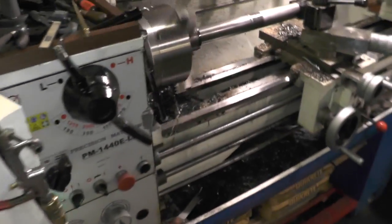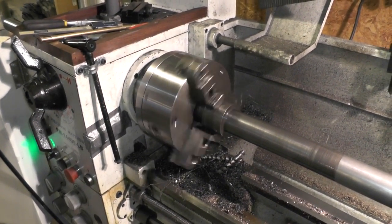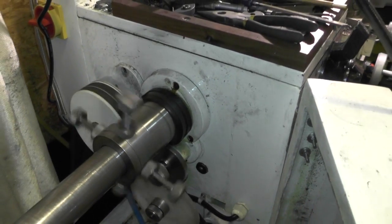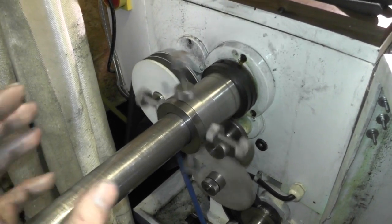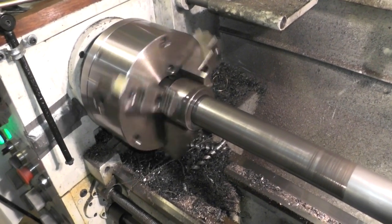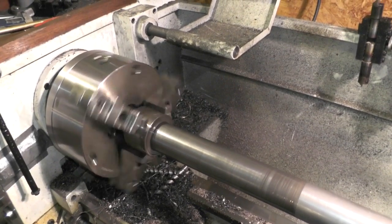On the very end there was a bushing I made out of some steel I had laying around. I bored it out to a tight tolerance, pressed in a piece of bronze, tossed it back in the lathe, and cut the OD of the bushing roughly a 16th under the ID of the spider — to give it enough clearance that it could shuffle around and get everything running true. On the chuck side, I did pretty much the same concept: chucked up a piece of steel, pressed in a bronze bushing, then finished out the bore to 1 inch 874.